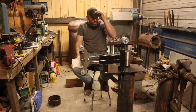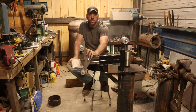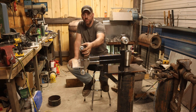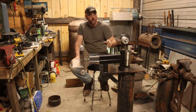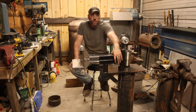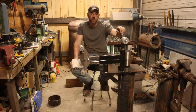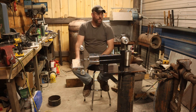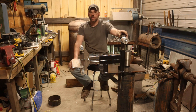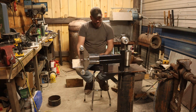All the wheels are lined up, we've done all that due diligence. Per viewer suggestion, I welded the half-inch bolts on the back side so I could get these a little looser so they turn a little bit freer. The hole that the threaded rod goes down — that we're going to hook a foot pedal to — I think I'm going to hog that out bigger, not so big where the spring comes through, but so it doesn't catch on the hole itself. I grounded down some but I think once we have pressure from the belt that won't be an issue. If it is, I'll find a shim or grind those off and put new shim stock on.